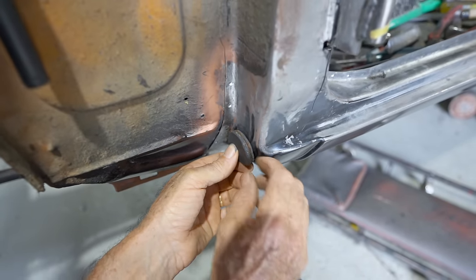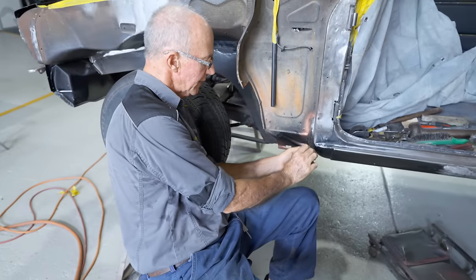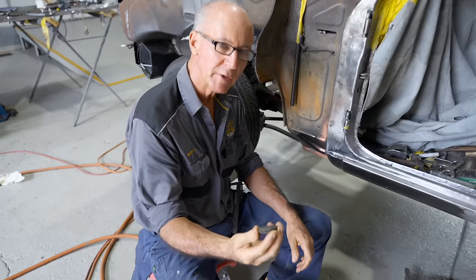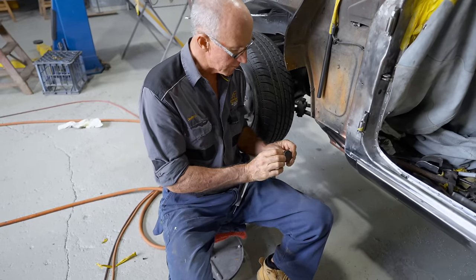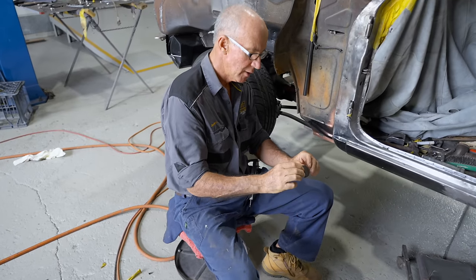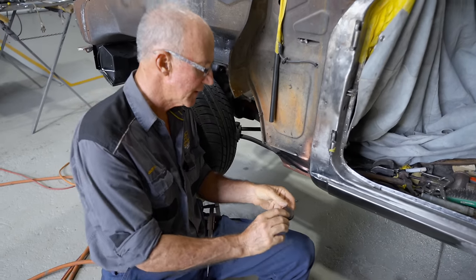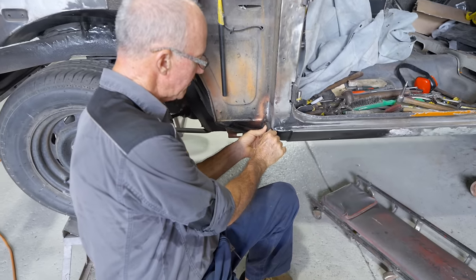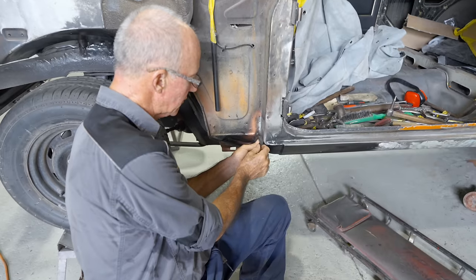So hopefully my measurements through here and through here are pretty correct, and I've got the 37 mil OD diameter for that bung now. We'll probably go, I'd say, with brand new bungs anyway, but as long as they're a fairly accurate fit to the old ones, that'll just push in the hole, push your inner skin of the bung in, if you like, and then in she goes and it'll lock into that groove.